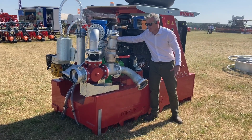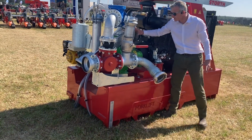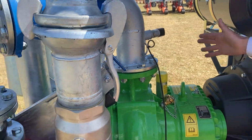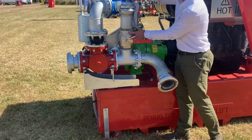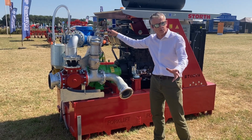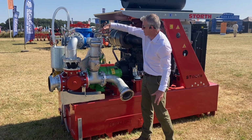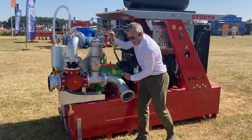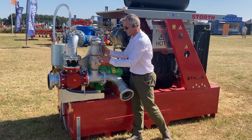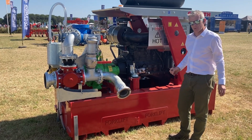We've got here a pressure sensor, and the pressure sensor on the pump is standard on our machine. You can see that around here. You've also then got the sponge chamber for afterwards, so potentially we can also connect that up to a compressor, and if you want to, you can control that compressor remotely. One-way valve here to stop slurry going back to the compressor, and we can blow our pipes out after we've finished, again remotely, and if you really want to, you can put a sponge in there as well. So that gives you a bit of a summary on the pipework side of things.